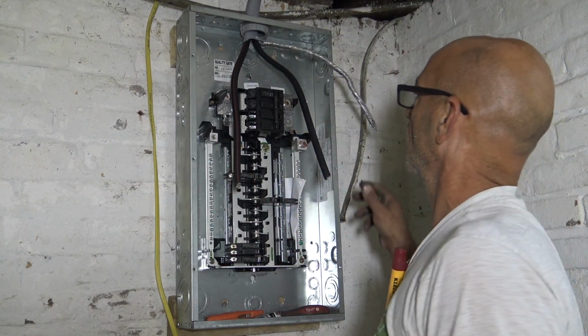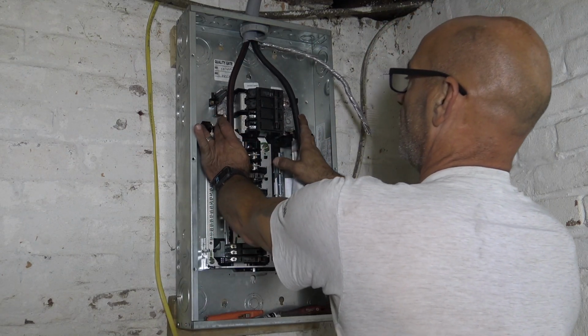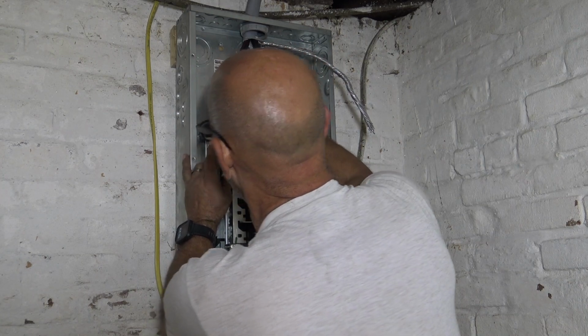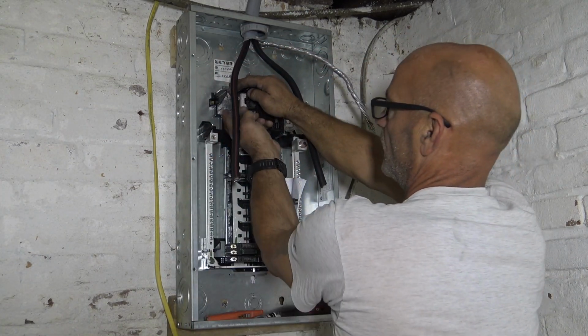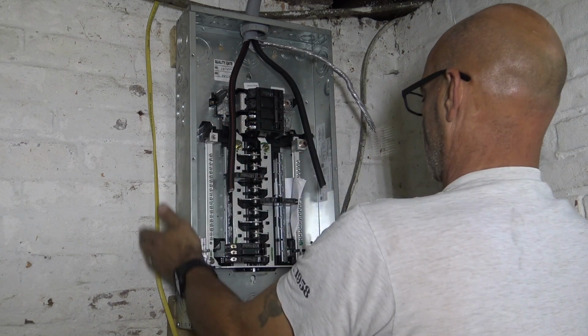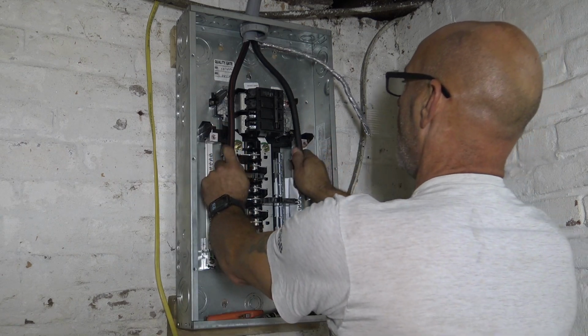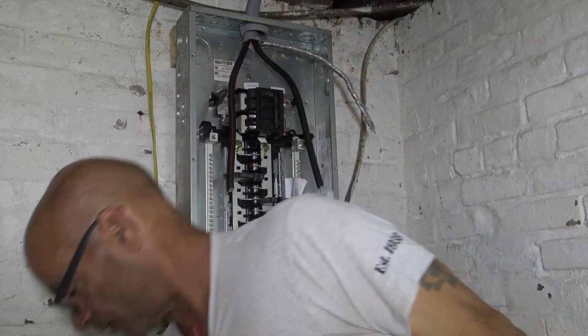Okay, I got this stripped, I got the wires bent, moved over where they go. Now this wire does not go all the way through. It actually will bottom out on this plastic covering here. Looks good. I got the panel installed at the proper height. Remember, you screw up here, that's it. New wire, do it all over again.